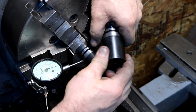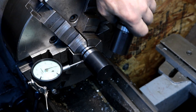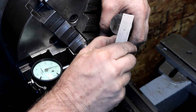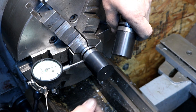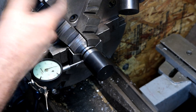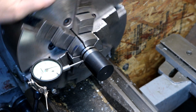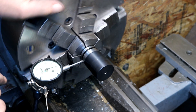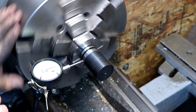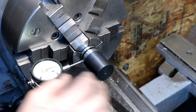It's not going to have a super long shank because it's only about 40 millimeters here — about inch and three-quarters, roughly inch and five-eighths. These things are an inch and a half in diameter. I've got it in the six-jaw; I was going to do a collet but I figured I could get it even better in the six-jaw because it's an adjustable chuck. I've got it dialed in — we're looking at less than half a thousandth for sure. It's almost like measuring the surface roughness. That's probably the best I'm going to get.